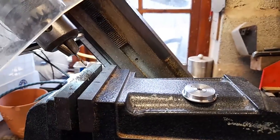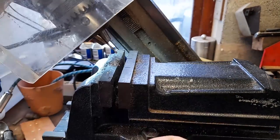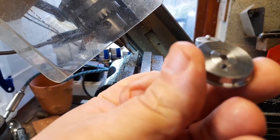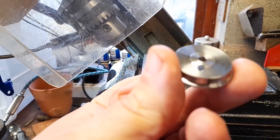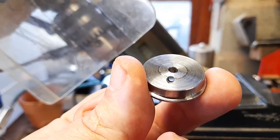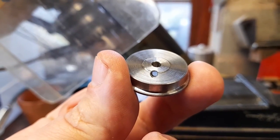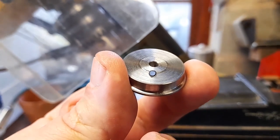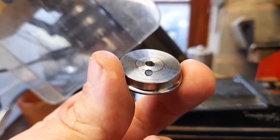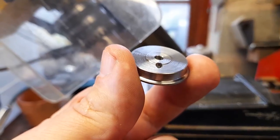Now I've taken this wheel blank out of the machine vise and look what's happened here. You can just about see through the hole. I'm going to fit the M3 thread to it now, so when the grub screws arrive I can fit them. That is pretty much the wheel blanks turned into wheel sets. Job done. Well, now I've got to do the axles, the outside cranks, the crank pins, the axle bearings. But hey, it's the end of the beginning.